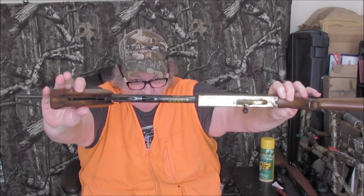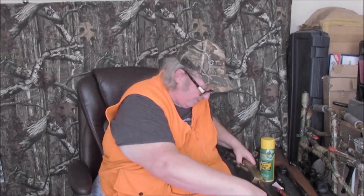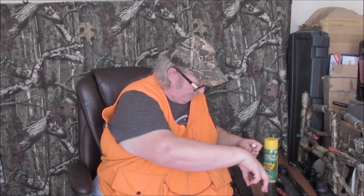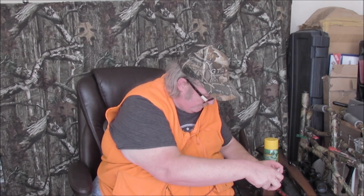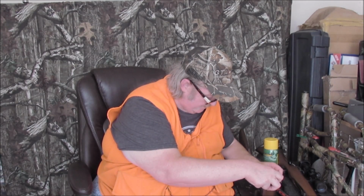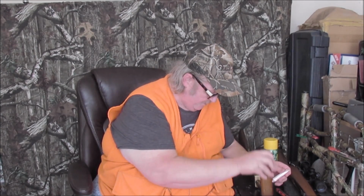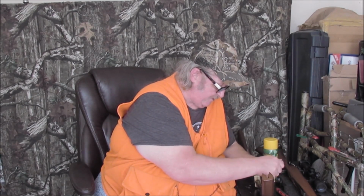And you can see that it's got the old school adjustable piston in it with the black cup around the outside of the piston that actually forms the seal, with that felt band around there that takes the place of what would be the oil scraper ring on a car piston. In this case, it's the oiler piston. And that's it, baby. Soak it up. Two or three drops of oil and work it back and forth a little. There, third drop, and we'll call it square.